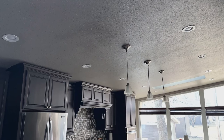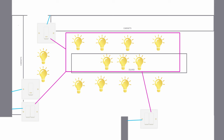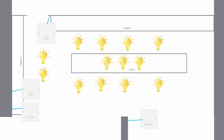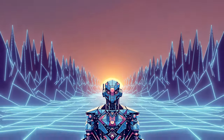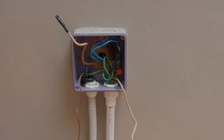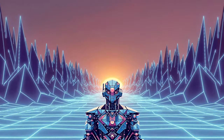Another thing that led me to want a smart home was the lighting layout. Our kitchen has two rows of five can lights as well as pendants over the kitchen island. On the first row, four cans were controlled by a four-way switch pair — three switches that can all control those lights — which also controlled the pendant lights. A three-way switch controlled a second row of four cans. The last two cans are controlled by yet another switch, so there are six switches to control 13 lights in the kitchen.